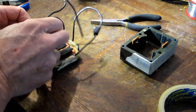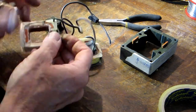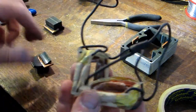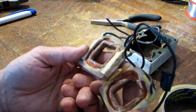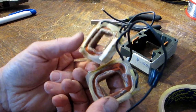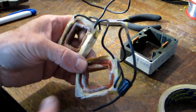They're loose but not coming out because the original motor coil is melted. Now these coils are both detached from their pole pieces, so all I need to do is strip the wire off because I have to count how many turns each has, figure out the wire diameter, get some more wire, make some more bobbins — some formers for the wire to wind on — wind them up, put it back together, and hopefully I've got a running motor again.